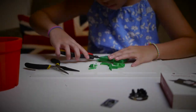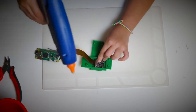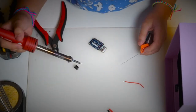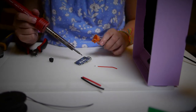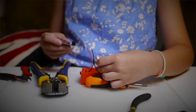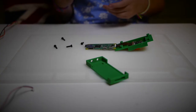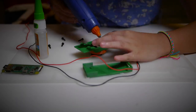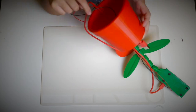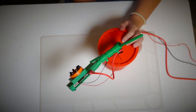With all the parts printed and ready, all that's left is the final assembly. I started with putting the brain and camera into the main case. There's a bit of soldering here. I needed 12 volts to power the IR array, but the Pi Zero only needs 5 volts. So I used an Adafruit buck converter to convert power for the Pi and also supply power to the IR emitter. Finally, to assemble the pot, run any wires along the inside of the pot and up the stem and clip in place.